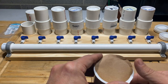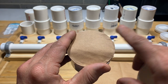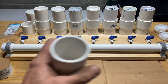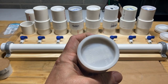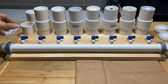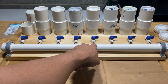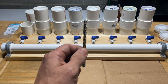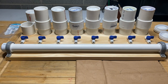As it goes into the coupler, the edge gets pushed up along the inside. I place the paper on top and center it, then push straight down - that pushes the edges up and gives a nice clean airtight seal. Each cup also needs to be capped off to keep any trace moisture out of it. Just write the paint color right there on top of the cap. I've already got marks underneath for where the cups are going to sit, as well as marks along the manifold where I'll drill with the quarter-inch drill bit. The cups work out to be about three inches apart - the middle of each cup is roughly three inches from the next.